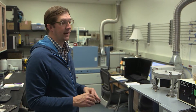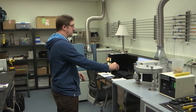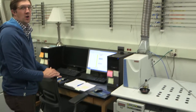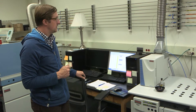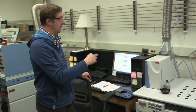Once we've done that and separated out the nitrogen and the carbon, we can measure those independently. They are piped over to the mass spectrometer, where the sample is introduced into the ion source, which is down in here. It's basically a really, really little filament, like a light bulb, but at a really, really high voltage — about 3,000 volts. Once the sample has been converted to gas in the elemental analyzer, it comes to the mass spec and hits that filament. It's ionized, meaning we knock off some of the electrons in the outer shell of the gas molecule. Then it has a charge and can be accelerated through a magnetic field.